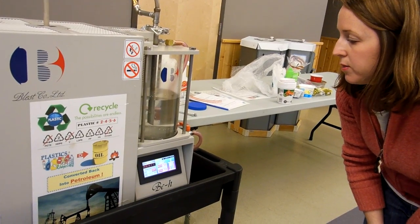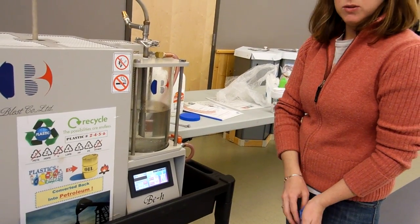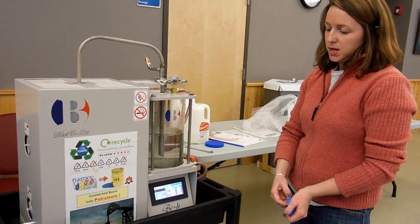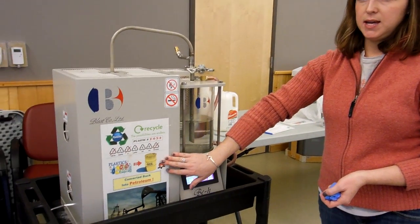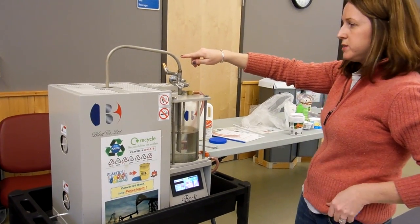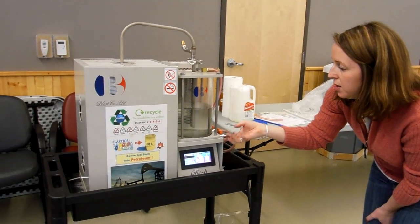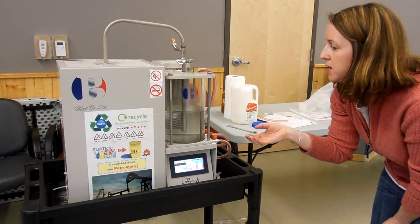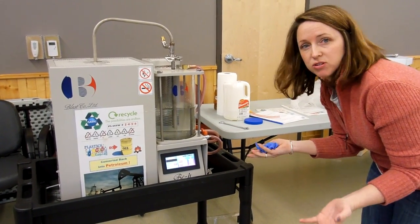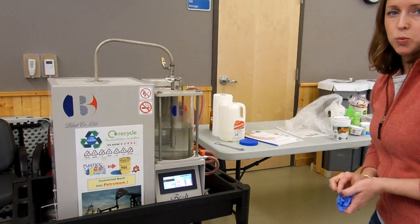It's heating. The first initial process takes about two and a half to three hours depending on what types of plastic you have loaded. Usually with the lower density plastics it doesn't take as long. What's going to happen is these plastics are going to begin to heat up and melt, then the gases of those plastics are going to travel through this tube here and all the way down into the bottom of the pipe. Those bubbles are going to travel through the water and condense and start to rest on top of the water. Since oil and water naturally separate, they're just going to rest there, and that's when we're able to drain off the top when the machine is done.